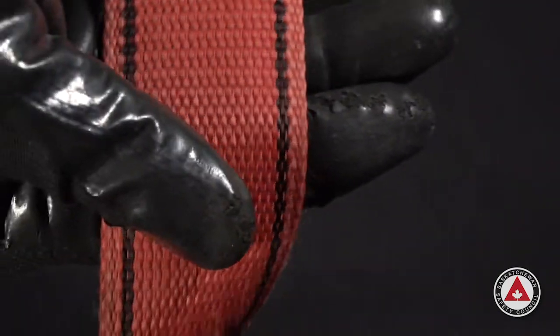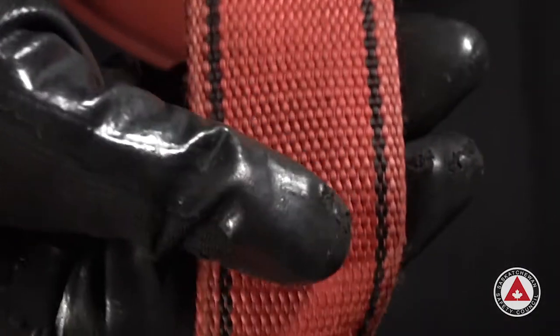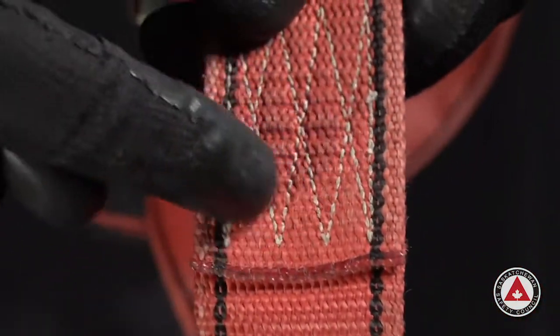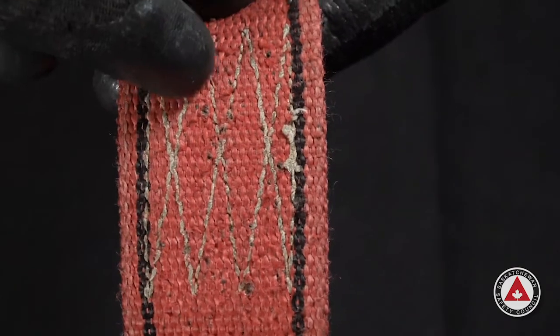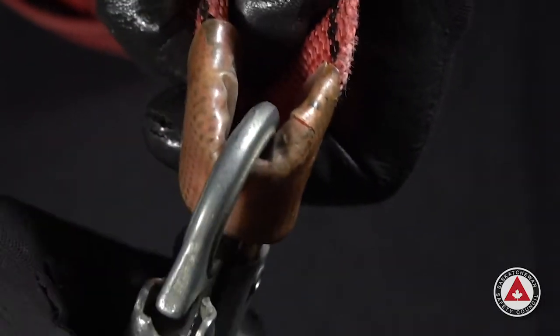Now we're seeing a lot of burn marks and damage on the webbing. We would take it out of service for that, especially when we have burn marks on stitching — it's weakened the stitching. This has got a wear pad on it that goes through the eye of the hook, just to make it last longer because the hooks are always moving and wearing the webbing out. Check the other side of the stitch pattern to make sure the pattern's intact — no broken stitches, no abrasion on the stitches. In this case, we do have a burn on some of the stitching, so we would take that out of service. Stitching is very important, so it has to be in good condition. We're also looking at a wear pad — wear pads can be damaged, because that's what they're for. They're to make your equipment last longer.